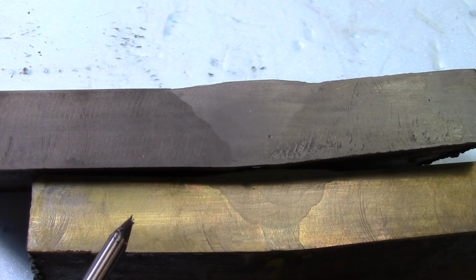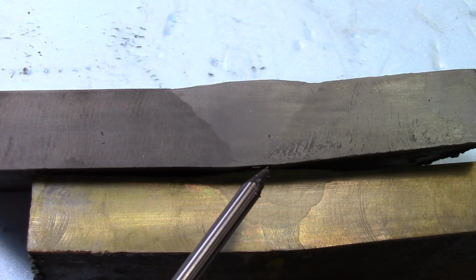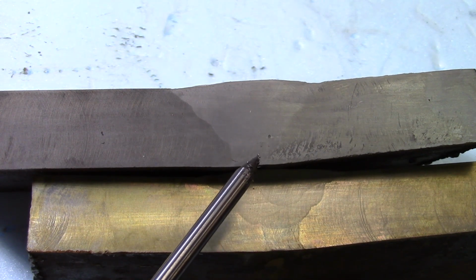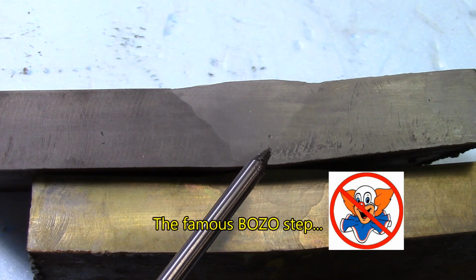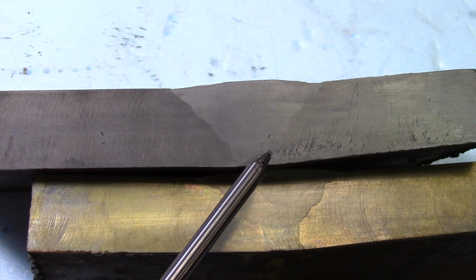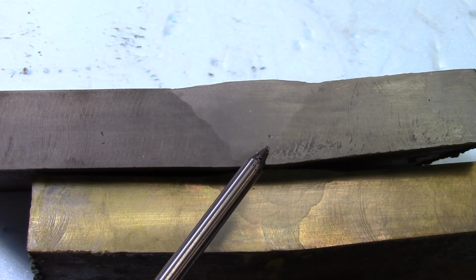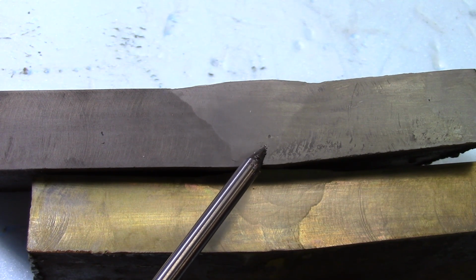Now we want to examine the second part of the coupon. The biggest defect in this one that we can see is the little inclusion there. When Philippe says, "Oh, let's go to the end and just come back on our step and back and forth," to just going back to the start of the weld. You never come back on your own step without taking off the slag and making sure that there's nothing there to interfere that could get included into the puddle. This is one of the consequences of doing this.